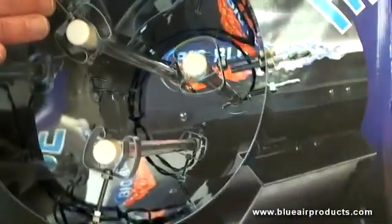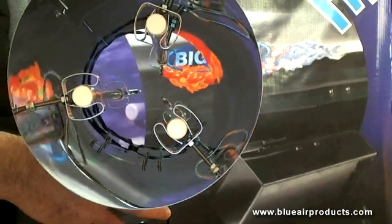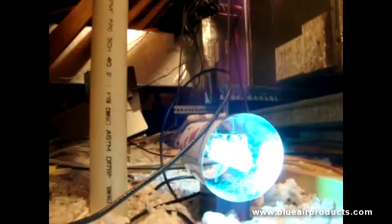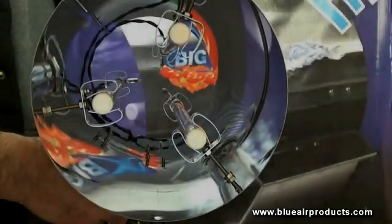In order to get that contact time, I can accomplish it in a number of ways. I get my contact time inside the attic, or inside that space underneath the house or above the ceilings. That contact time would allow me to use a Big Blue with fewer lamps, because I've got more contact time. So instead of a 2,000 CFM fan requiring a 10-inch unit exhausted straight to atmosphere, I could probably get away with a 6-inch Big Blue with two lamps by dumping into my attic.